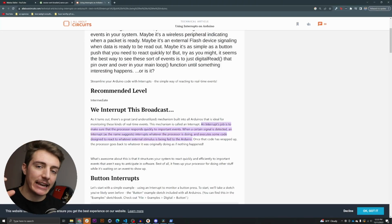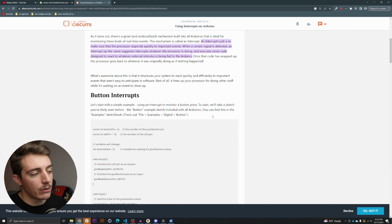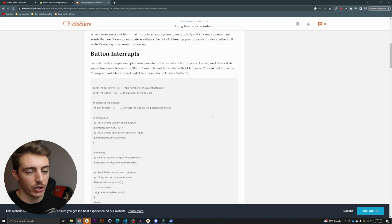We have a little bit of a delay issue between the Python API and the actual code that lives on the ESP32 board. For the moment, the way I do it is that I send my instructions line by line to the Arduino, read them, and then resend something that says, hey, I am ready for the next line. But I would like to send actual chunkable data and maybe keep everything in a buffer so that we can read it as the code goes along. So I asked around and educated myself a little bit, and apparently I need to know how interrupts work. This is something I saw in college, so it does go back a little bit in time, but it should be something I look into to understand how that works in general.